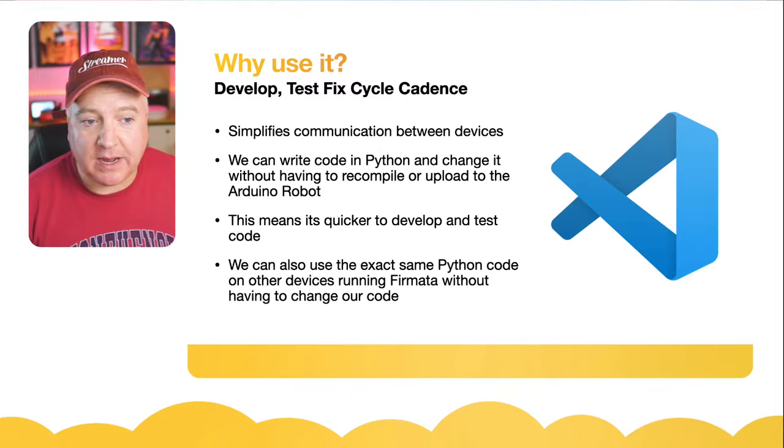So one of the questions there is, can Pi Arduino pins be used as serial communication instead of serial pins? Absolutely, yep. Almost every pin on a Pico, for example, can be used as a serial port. There's not many that you can't. And can multiple Arduinos be used with one Pi? Absolutely, yep. You could have multiple of them.